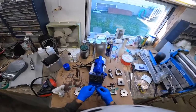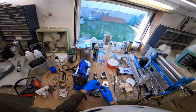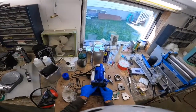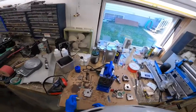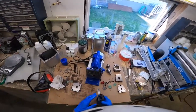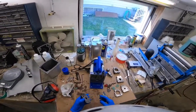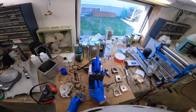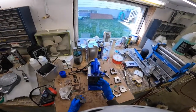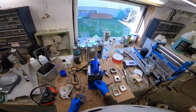I cleaned out inside of the o-ring grooves. I'm not going to use any sort of assembly lube for two reasons: one, I don't want to use my regular assembly goo because it's going to contaminate the oil. It's actually important to use vacuum pump oil in vacuum pumps, and part of the reason is because it has to have a low vapor pressure point. Ordinary oil can actually off-gas, and under a vacuum it's way more likely to do that, so potentially you could have a perfectly working vacuum pump and just by putting the wrong oil in there it wouldn't pull a vacuum because the oil itself would produce so much gas.